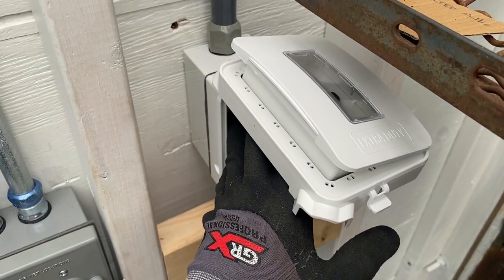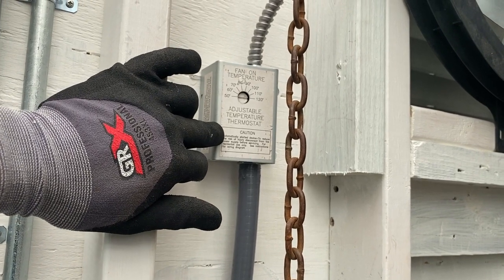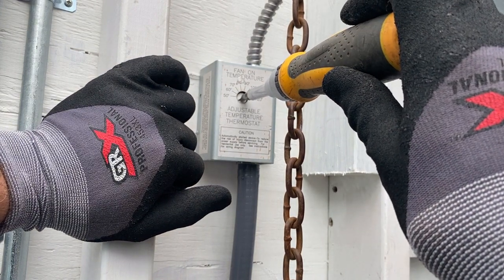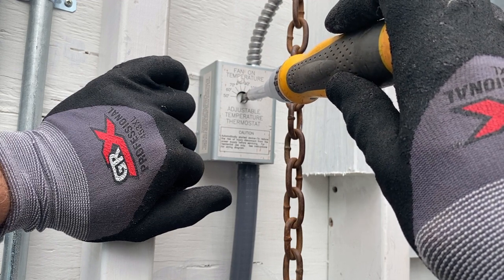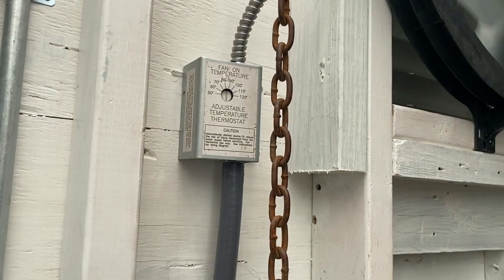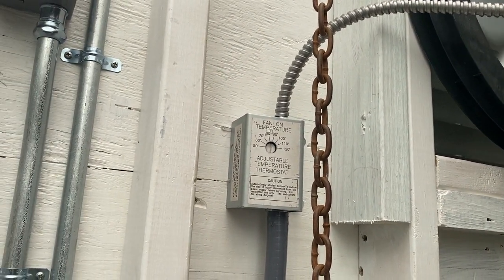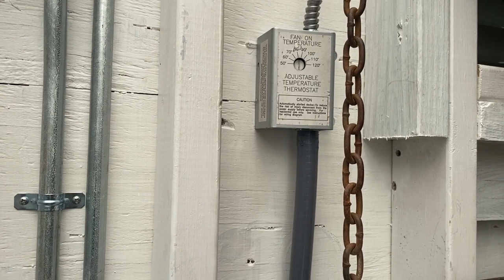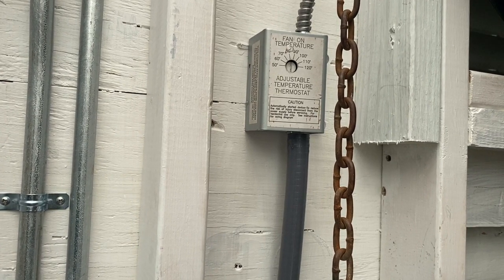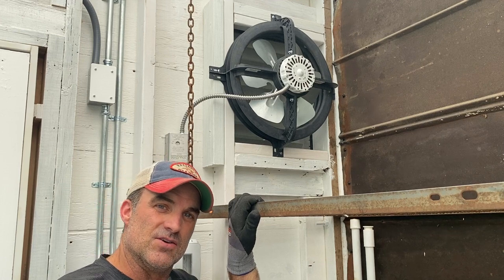Cover's installed. I'm going to go ahead and flip the switch on and adjust the thermostat on our attic fan. It's set at 120 — you can take a flathead screwdriver, stick it into the slot, and turn it to your desired temperature. It's probably about 80 to 85 degrees in here right now, so it just kicked on. It's nice and quiet. I can feel a breeze pulling through — it's working really nice. That's pretty much it. It's pretty easy to install. The hardest part is if you're in a real tight area in your attic. I hope this video helped you install your own attic fan. Thank you for watching — you can do it. Stay tuned for the next video.